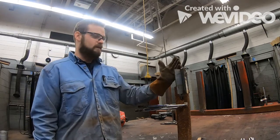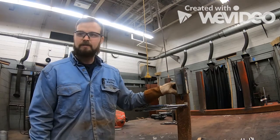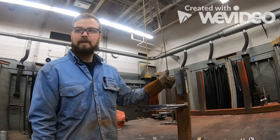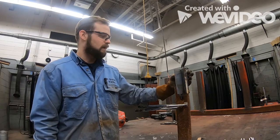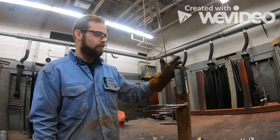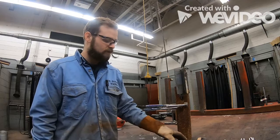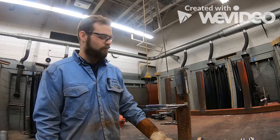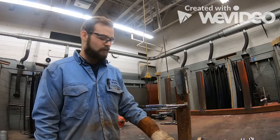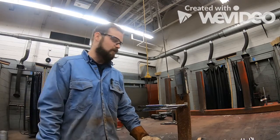I've already taken the time and set up my post here. This was our padding project from a couple weeks ago, and all I did was create a fillet or T-joint and tacked it up. Remember, just a couple of tacks down at the bottom holding onto the table — the more you weld on it, the more you're going to have to grind off.